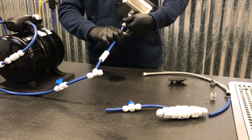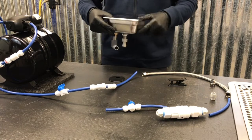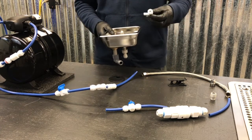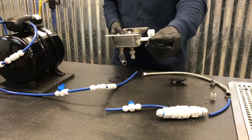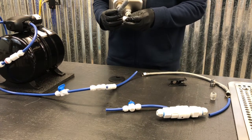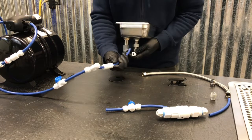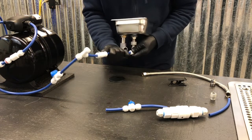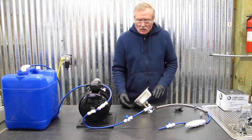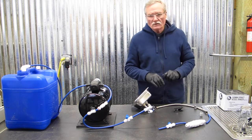The installation is quite simple — take the tubing and install it into the John Guest 1/2 inch BSP connector at the bottom of the rinser and push it up until it seals. If you're in a low clearance situation, you can utilize a John Guest elbow fitting placed into the connector on the rinser and then into the John Guest tubing. With the rinser installed, we can now move on to the espresso machine connection.